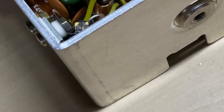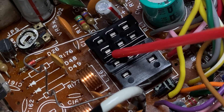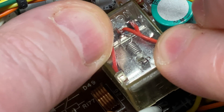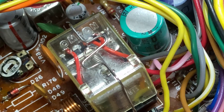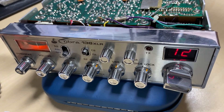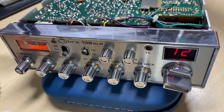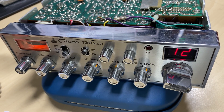So let's put it all back together and see what happens. But before we do that, we're just going to put a bit of contact cleaner into the socket — I doubt that was the problem, but we'll do it anyway. And there's our relay securely in place. Sure enough, I can't get it to go off anymore — no amount of tapping or switching the relay will get it to fault, so I think we've cured it.